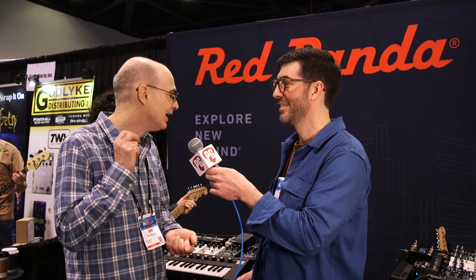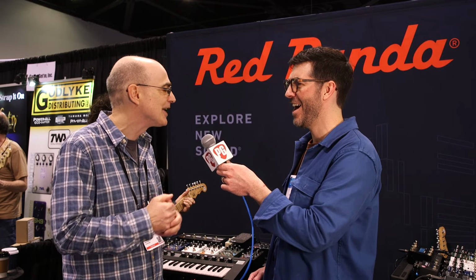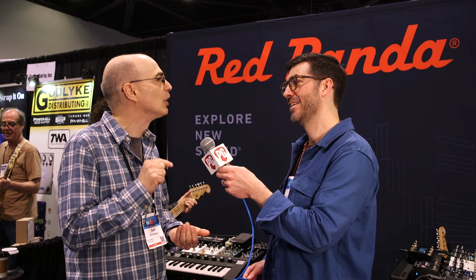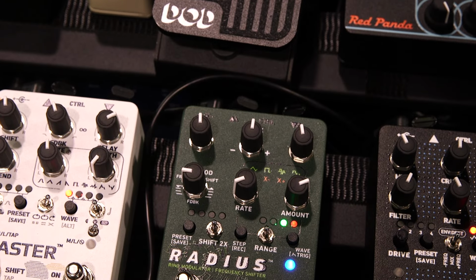And then on top of that, it has an advanced LFO that you can sync to tap tempo and MIDI with different waveforms, a couple random waveforms, triangle, square, step modulator. You can program in up to 8 steps, and then a couple that create spectral sweeps that give you kind of endless glissando type of Shepard tones, envelope filter, and then a lot of those waveforms can also be envelope triggered. So like with the random, each note you play, you get a new random sound out of it.